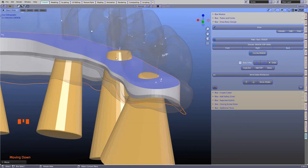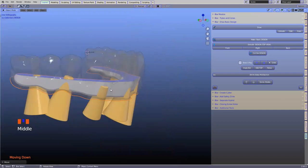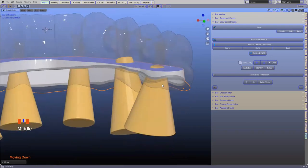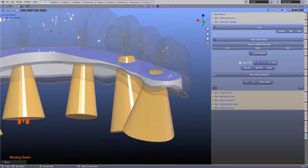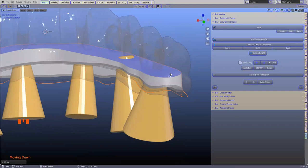A thin bar at an angle of around 30 degrees can pop through there — it doesn't matter. What is the top of that cylinder? That's the housing that will house the screw head. Remember, we put the cone vertex to the level of the top of the screw head, so that will become the actual enclosure of the screw head. Even if it pops out and there are space constraints, at least we've got the screw head encapsulated in the middle. This becomes part of the cutting tool.